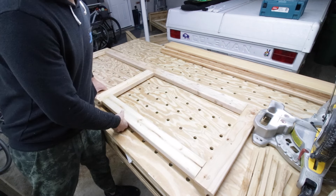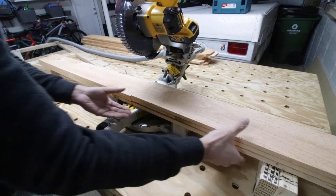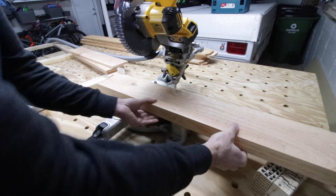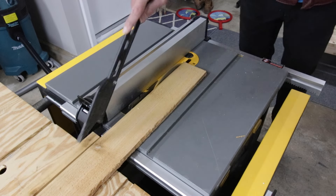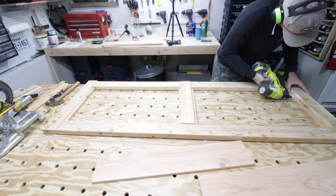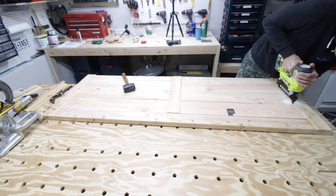So like I mentioned earlier, once I put the couch together I realized that the backrest just didn't look good with the two by fours in the back. So I took out the middle ones, bought more cedar fence pickets, and here I am cutting them to length — this will be the back for the couch and will help support the cushions as well as look good if the cushions fall down. Then I went to my table saw and cut the cleats down to width, then to my miter saw to cut them to the right length. I did the same thing I had done on the outside armrests — I attached the cleats with my nail gun, then attached the slats one at a time, making it look nice and clean.